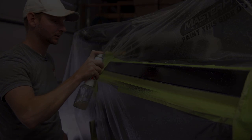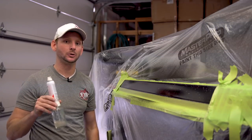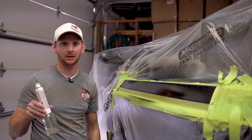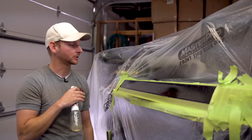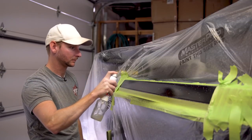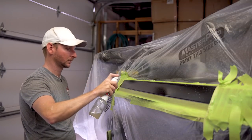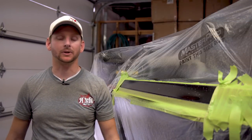We've got our first two layers of clear on. The final layer has our wax additive in it — you can use between two to ten percent; more towards two to five percent is preferable. It's a little cold this time of year so we've got closer to ten percent wax additive. We'll do our final layer of clear with the wax and then leave it to cure. Once you make the final sweeping pass with the wax additive, do not bury it — let it come to the surface and let it start to kick. Then the last step is just a wet sand and polish.